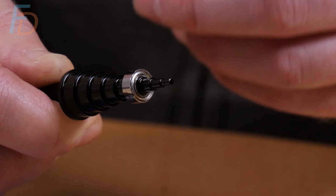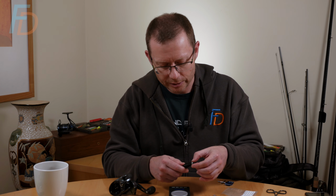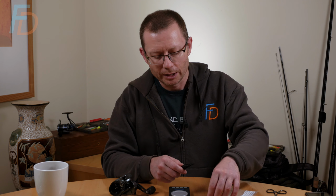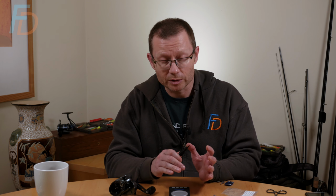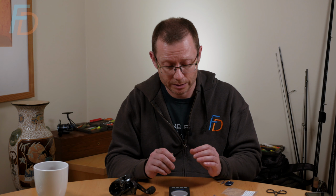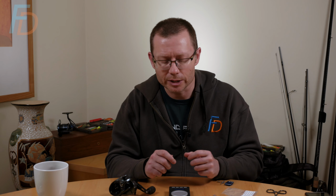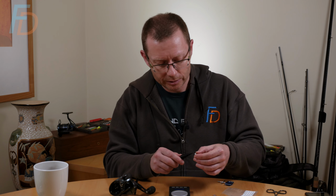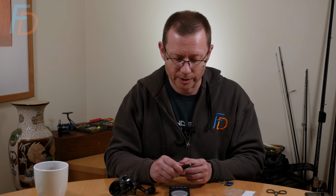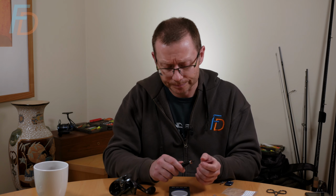That's possibly slightly unfair as a measure, because when factories and manufacturers ship these bearings, they tend to want them as smooth and as quiet as possible, so they load them up with grease. One of the tests we'll get into subsequently is cleaning that out and seeing what performance you get with the cleaned up, degreased bearings. But just as a comparison, again, these are not super expensive. They're not even like BFS micro bearings. They're a ceramic and steel hybrid bearing.